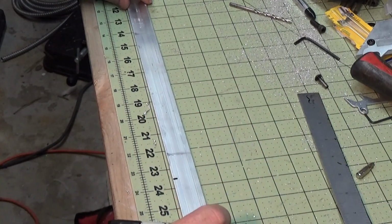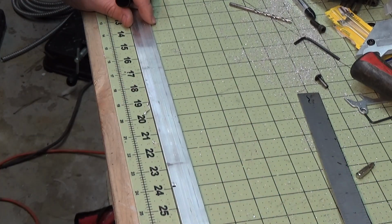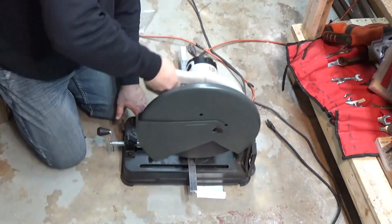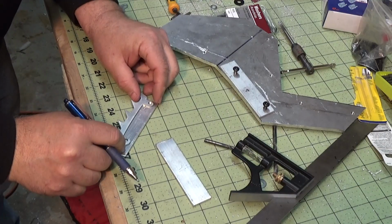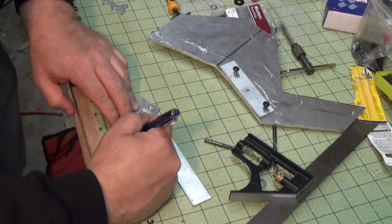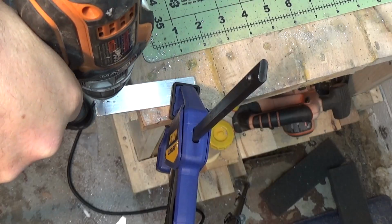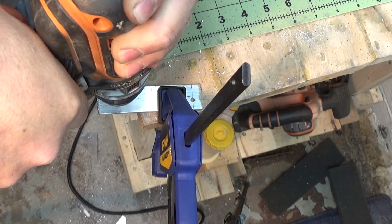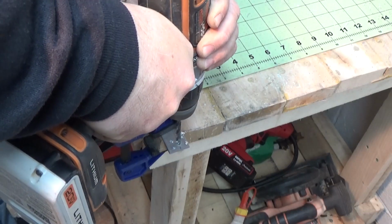The second way, you'll need another 16 inches of a 1-inch by 1/8-inch thick aluminum flat stock, and that will add another $8 or $9 to the cost. I had a spare piece laying around, so that's why I used it. If you go that route, you need to cut 4 pieces at 4 inches. Trace where the dog holes need to be, center punch and drill a hole for the two 10-32 bolts to go through. Do that for all 4 pieces.